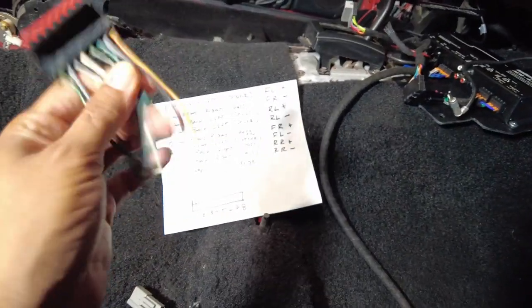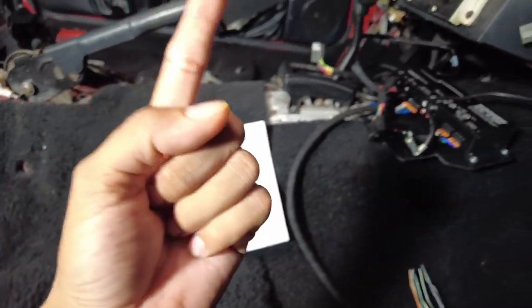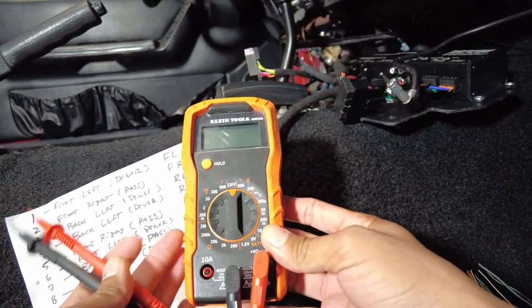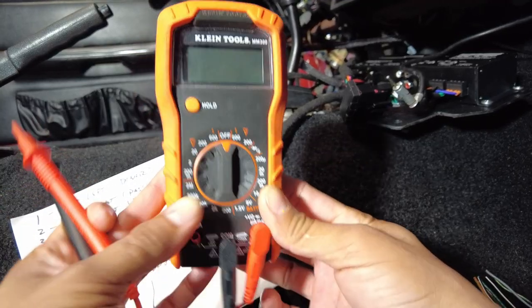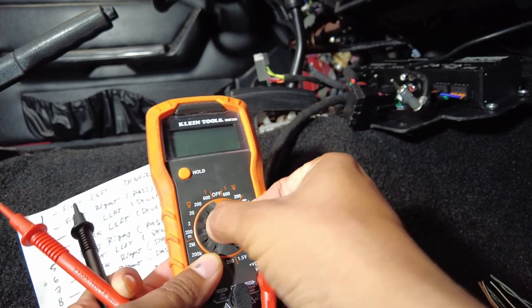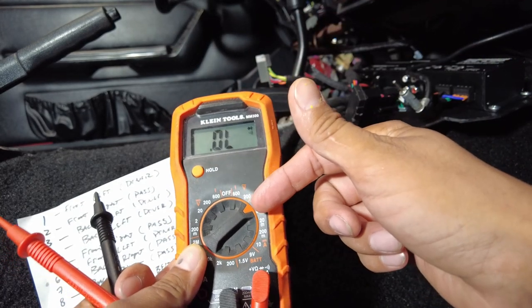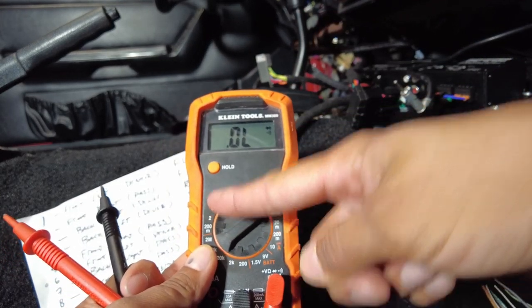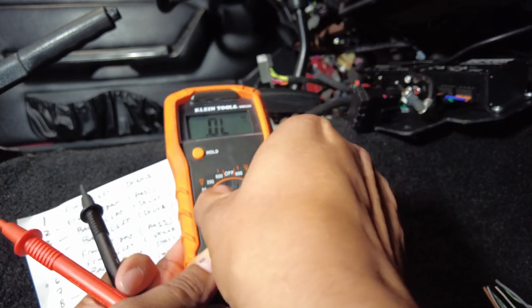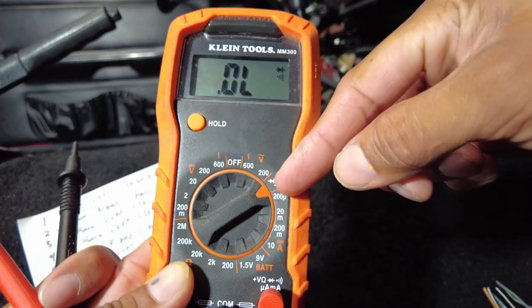So how do you repin and how do you test? First, let's teach how to test. The way you want to test is get yourself a multimeter — any multimeter will do, you don't need something expensive. Go ahead and move it to continuity — that's that button right there. While I'm teaching you guys multimeters: that is battery, this one is your house electricity, alternating current. So when you want to test your batteries, go to that side. But back to continuity — it's the one right there with the little audio symbol.